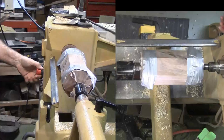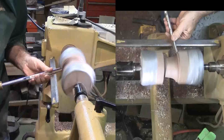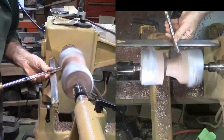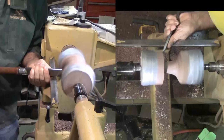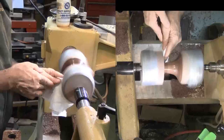In a normal turning, I'd rough turn the entire length. For inside-out, I will only turn the area that I want to be on the inside. This is very hard for me to visualize how the shape will turn out once inverted back around into the inside. I have to be careful to cut at an angle. This is especially difficult on the flat area I want to be at the bottom. But my trusty gouge at the correct angle does the trick. I'll clean up with a round nose scraper and my skew. Then carefully sand this area, as there will not be a chance to do it later. And finish it with shellac friction polish.